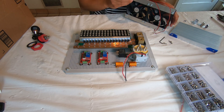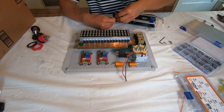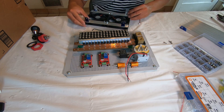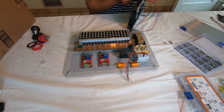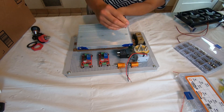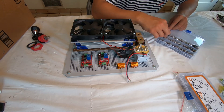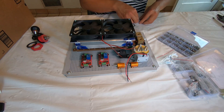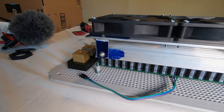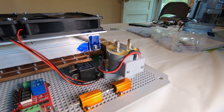I can now mount the heat sink and fan assembly. First I mounted the two aluminum strips to the two fans with wires facing the same direction, then mounted the L-brackets to the two strips. After that I mounted the heat sink on top of the PWM control board, then mounted the whole fan assembly on top. I used plenty of Loctite to make sure nothing vibrated apart. Here's the heat sink and fan assembly dry-fitted — I'll clean up the ink markings before I'm done.